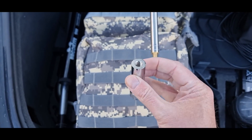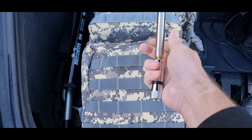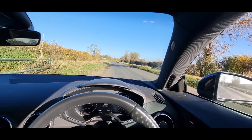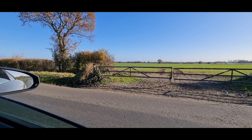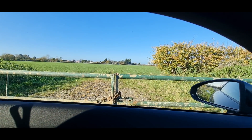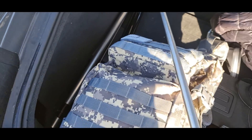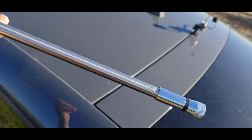It's going to need a bit of adjustment to get the right SWR on the radio because you've obviously got the ground plane underneath, it's going to affect things. The great thing about telescopic antennas is you can just slide them up and down to get the right SWR — you could use an antenna analyzer but in this case I'll just use the SWR meter on the radio. So here's my little PL-259 to 3/8 adapter which will just screw on and allow me to connect to the top of the car. Found a spot — it's pretty high, no really big hills around here, but let's give it a go.